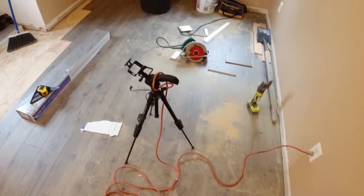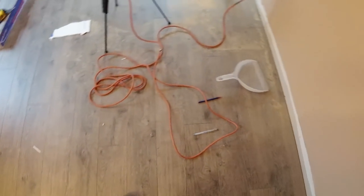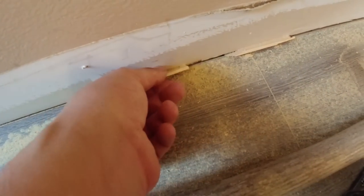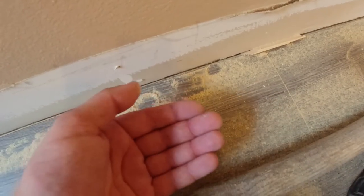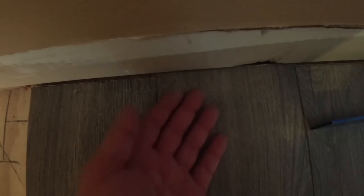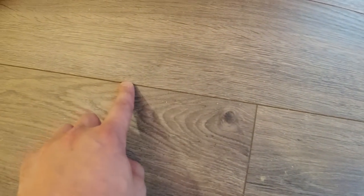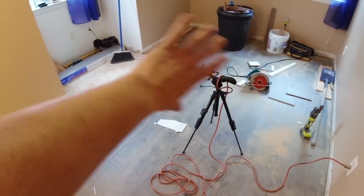Home stretch — the closet's all done. I have a little trouble with these spacers because the sheetrock is higher than the floor. So what that means is, as long as you get everything tight, this still has a place to go if it expands — it can go under the sheetrock. So that's fine. Just some of these seams go under and then some have gaps, but again, as long as it has room to move you're good. And basically the takeaway is just make sure everything is tight. Make sure all your seams are tight, or they'll pop out eventually. So I'm going to move everything, clean all this up, finish this out, and then nail all the baseboard back on.